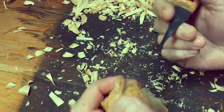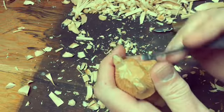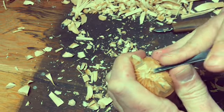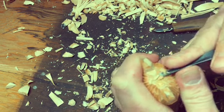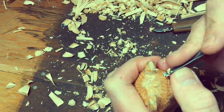This is a bit of a U-tool. They do that dolphin dive cut a little bit better. When you cut with a V-tool, they end up dragging out for a little bit longer. It's harder to do a scoop cut.